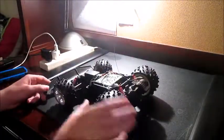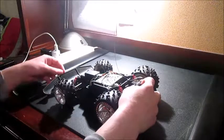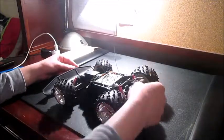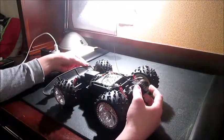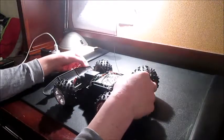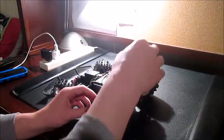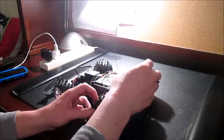Some specifics on the car: I don't want to go out and buy a new motor for this car, because that would just be a waste of money. I think what would be much better and relatively simple would be to convert this motor from a brushed motor to a brushless motor. That's as simple as taking off the brush assembly of the motor, making the magnets the part that moves, and the windings the part that is stationary.